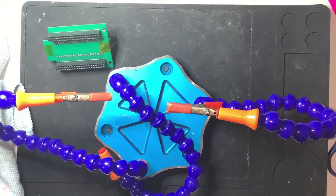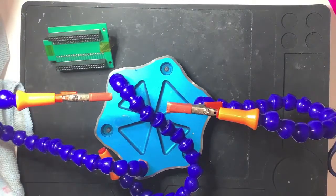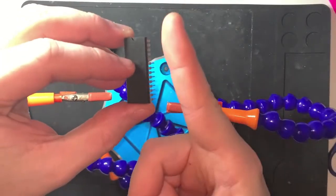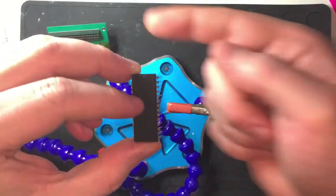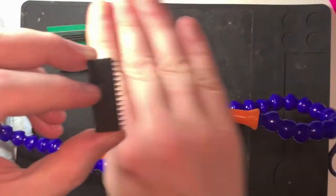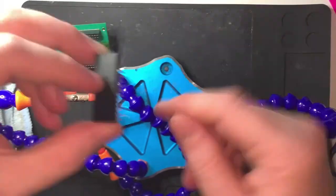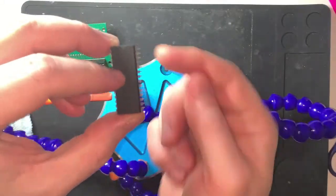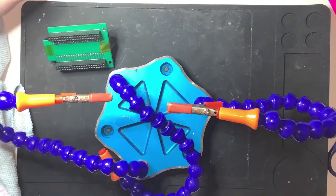Had a good trick for getting IC pins and boards: line them up as close as possible, and then run a flathead screwdriver along the sides of the pins, and they all magically drop in. Yeah. Does that work? So if you've got a, I don't know what I'm describing it for when I can just use visuals, he says, rubbing his knuckle on a hot soldering iron. So does that work for that axis? So bringing pins in that way or bringing them out? Because the problem with this one is they were bent in that direction, so the pins were that way and that way instead of. Yeah, we'll see.